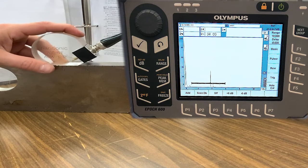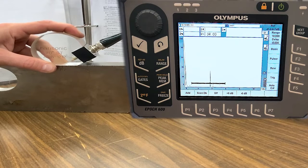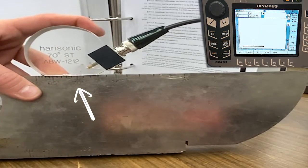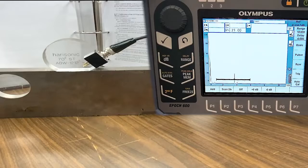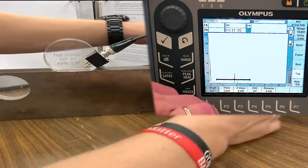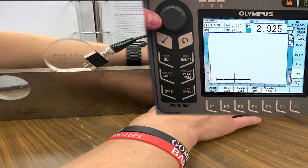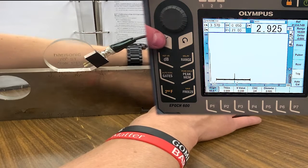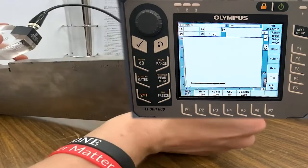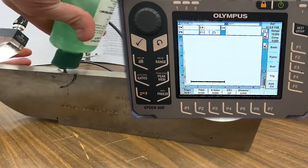Right where it goes to stop and turn around — right on the 70-degree beam exit point line. I like to take this opportunity to come to the trig function and inform the instrument of the angle we are working with. If it were 71 or 72 degrees, I would put the correct angle measure in there.